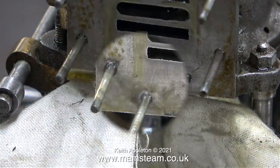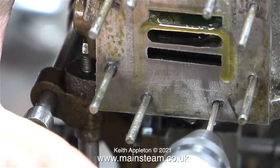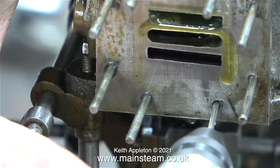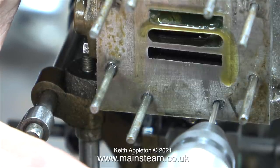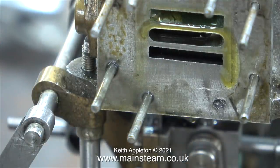In this clip I'm looking at it from a different perspective - I'm drilling a hole at the side of the broken stud, initially using a smaller twist drill and being very careful, because if the twist drill snaps off in the hole I can go no further. The plan is to drill a hole to the left of the stud where it's broken. It would have been much simpler to make a very short stud and stick it into the steam chest cover, but I want it to be functional.